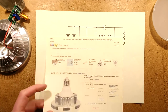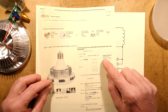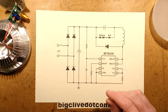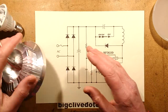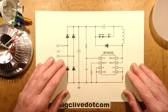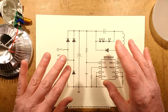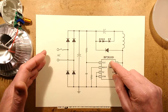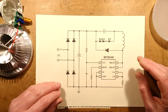In this case it's not that hugely expensive — just over about ten dollars for this particular seller. It remains to be seen whether it's — the circuitry — I'm not sure how hot this gets; I should have tried that. It's certainly not going to get too hot at 20 watts. I drew a complete blank on the chip; however it's got the same component layout as — not necessarily the same pinout but as — a BP2833D, which is the Bright Power type chip. The original chip was a 9504SB.